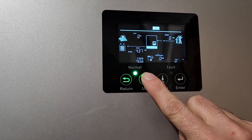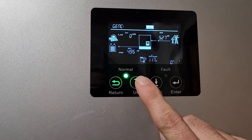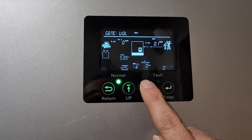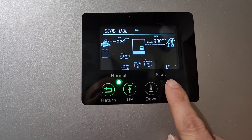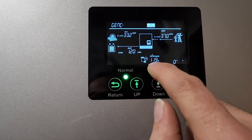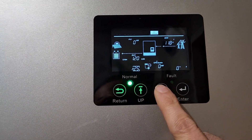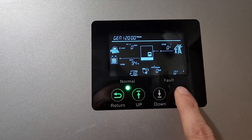Pulling from the generator. Let's go to the next setting — gen select. We have it set to voltage, not state of charge. Start: it's set at 54 volts — that's setting 25. Stop: ending at 57 volts. Option 25 is the state of charge voltage setting. We already did the maximum generator setting — that was setting 18.